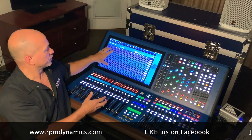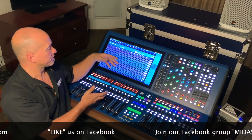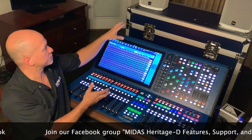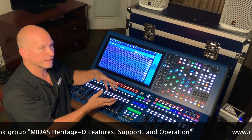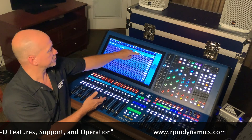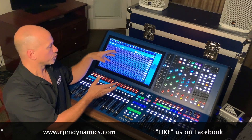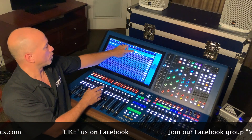All of these things through this mixer can be combined individually into 12 different places. They can be sent to a person, added into someone's IEM mix, or sent to Shout speakers in front of house and monitors. Rather than having to eat up channels or eat up aux sends, you now have the ability to use this Shout system to completely customize who hears what in your production experience.